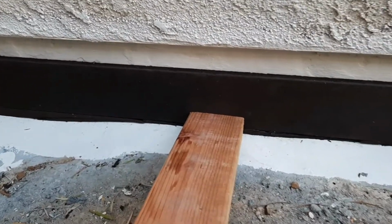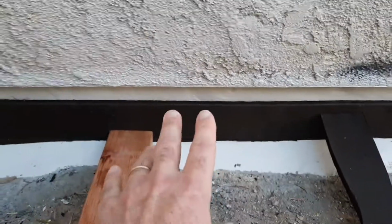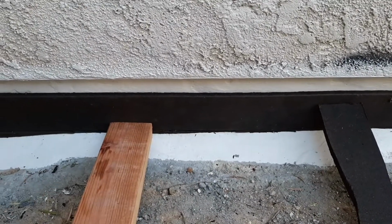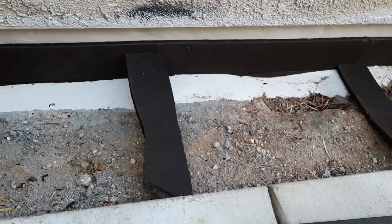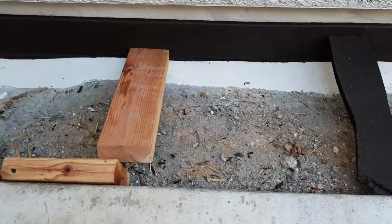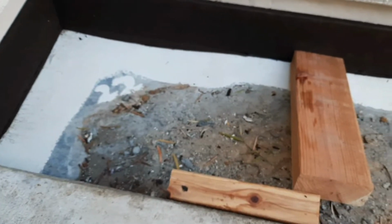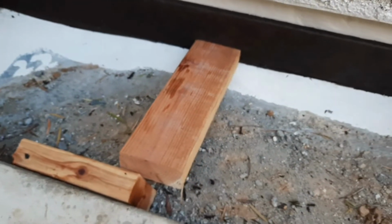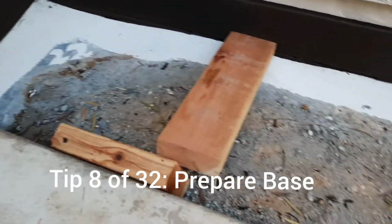It's interesting, when we applied the asphalt expansion product here, this area is not square or flat. There's a lot of undulation, so I've got it supported right now before we do the pour. And I also had to add more material down here because obviously it's not flat. This was an existing project. I didn't want to add dirt on top of it, and that'll allow the concrete not to settle quite as much.